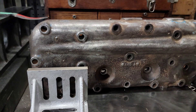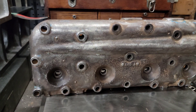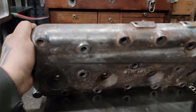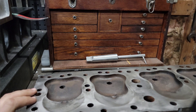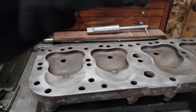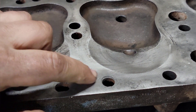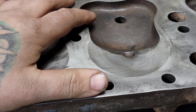In my opinion, when doing a cylinder head you don't want it super smooth. I like to have just a little bit of mill mark showing through - just enough to catch a nail, not like a file, just enough that it can bite into the gasket. This will likely have copper gasket sealer sprayed on with the head gasket. You can even see the factory cut here - there's just a little bit of roughness to it, and that aids in getting that gasket to stay put.